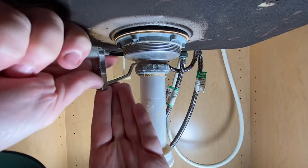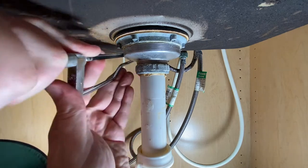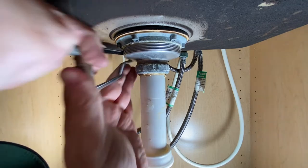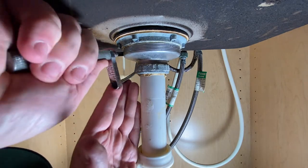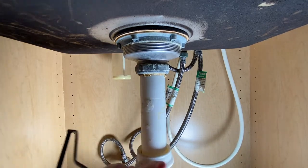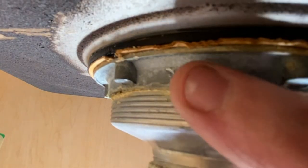Let's get back at it — make sure you have some glasses on, this is going to produce some metal shavings. It's a tight space, so I usually go to the side, just lay on your side and start cutting into it. We're getting a nice cut in it — I'll show you in a second once I get a little bit more on both sides, because we just want to cut this nut off. We don't want to cut the sink — that would be unfortunate.